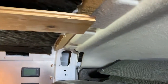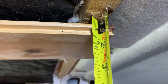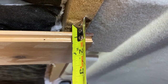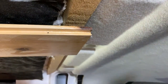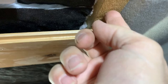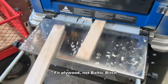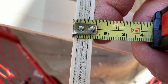I have a tape measure here and we've got about half an inch of drop. I could put a little bit of Baltic birch along this beam — half inch Baltic birch. I think I might do that, but I'm going to first run it through the thickness planer to bring it down to seven sixteenths. Taking a sixteenth of an inch off will allow this to just snug up a little bit. So all the way along this beam I'm going to put some half inch Baltic birch and thin it down to seven sixteenths.